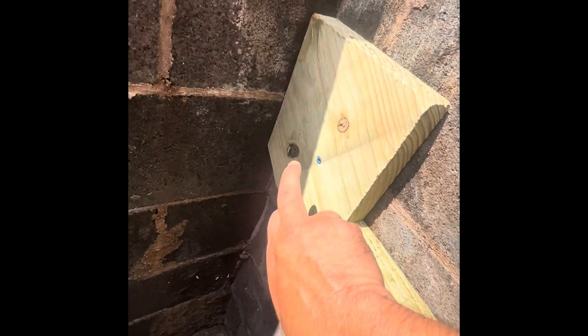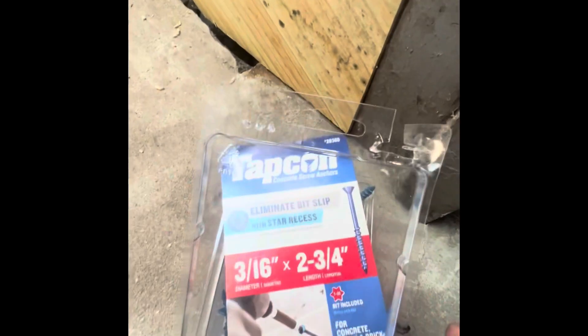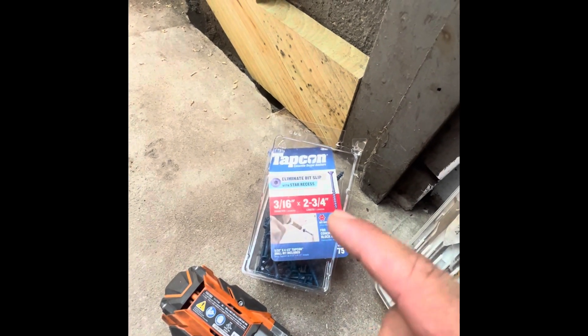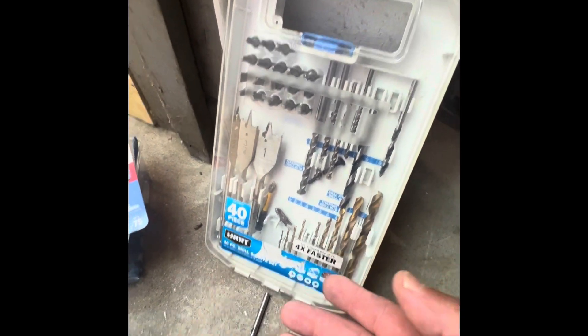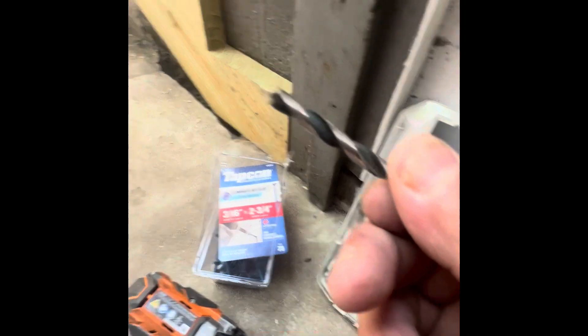The stringers are ready, in place where I want them, and they're bolted to the wall. Just to make sure it's clear — these are the screws I bought, at Home Depot. They come with the drill bit for the concrete and also a driving bit. To pre-drill the wood you have to use a separate wood bit — I had a set I bought at Walmart a long time ago that has wood drill bits, so you have to have that to make it work. And they're nicely in place, secure where they need to be.